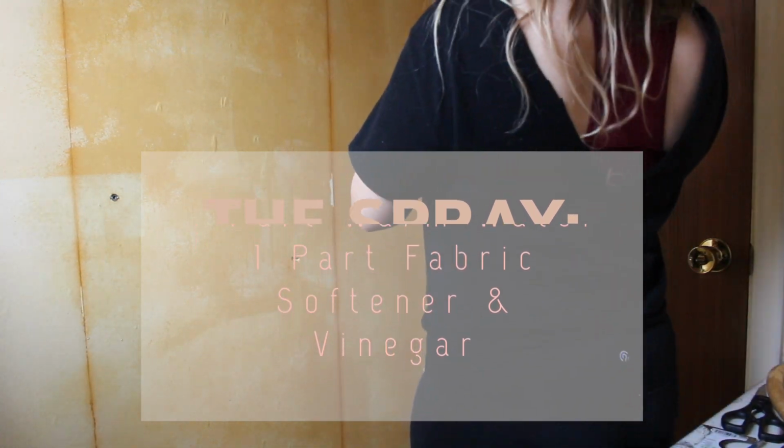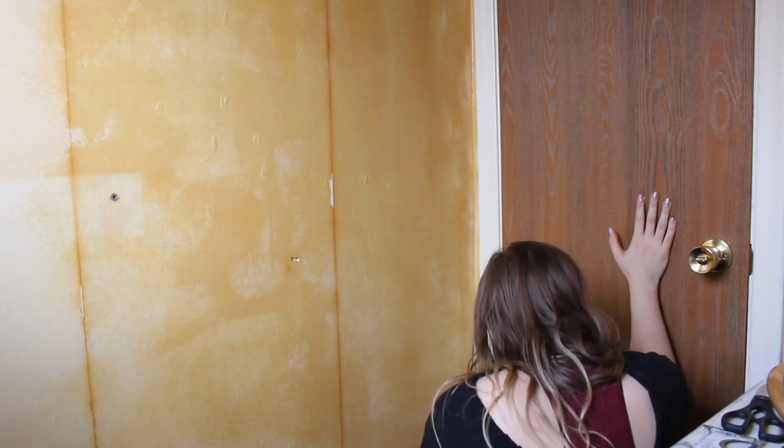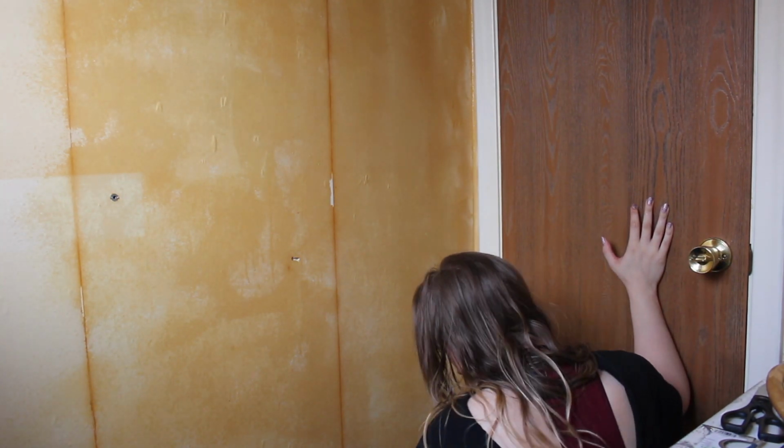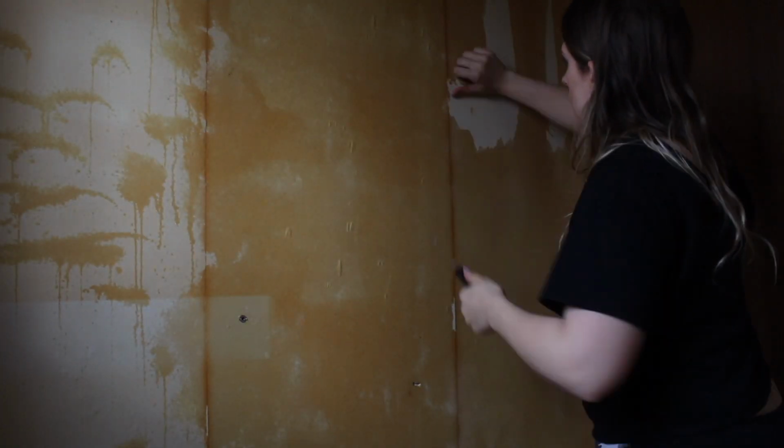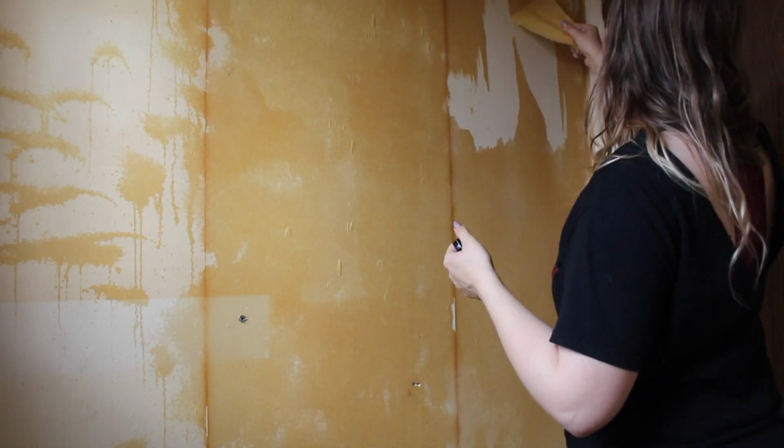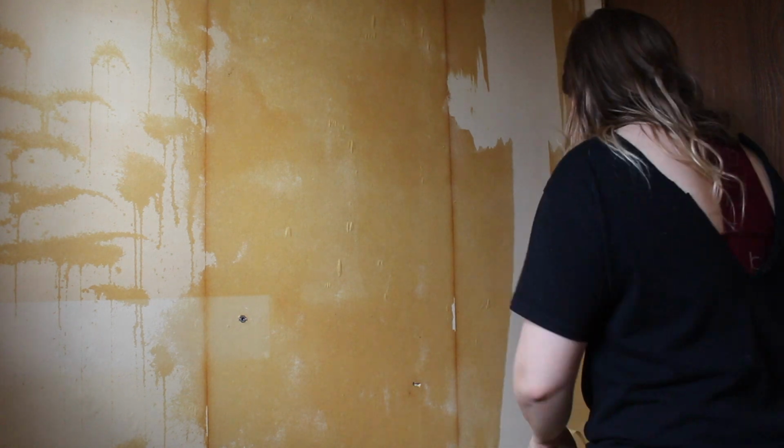After a long time of laboriously scraping and damaging a lot of my walls, I realized what helped me further on was actually sanding this top layer off, allowing my spray to penetrate further and allow for easier removal.